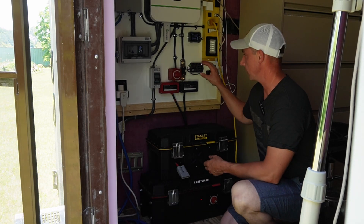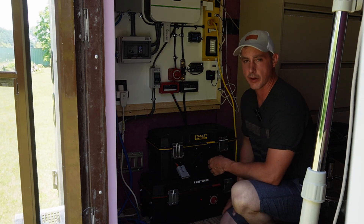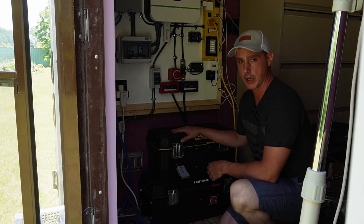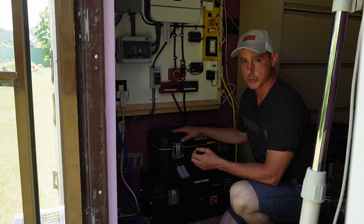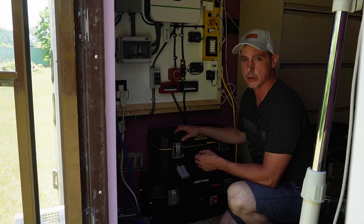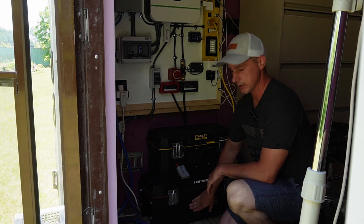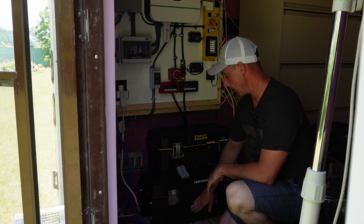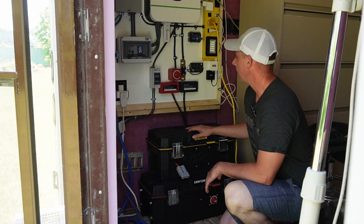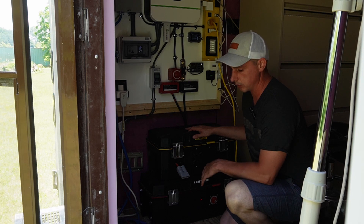In order to connect this I need to bring the first battery up to 100% — right now we're sitting at about 75% state of charge. Once it gets to full I'll make the connection to the second battery. Right now the air conditioner is off and I'm trying to utilize the sun as much as possible. It is warming up in here — we're sitting just below 30 degrees Celsius inside the trailer, and the battery box is still only at about 26 degrees. Hopefully this can get charged up without it getting any hotter in here. Once everything is leveled out at 100% I'll make my connection and fire on the AC again.